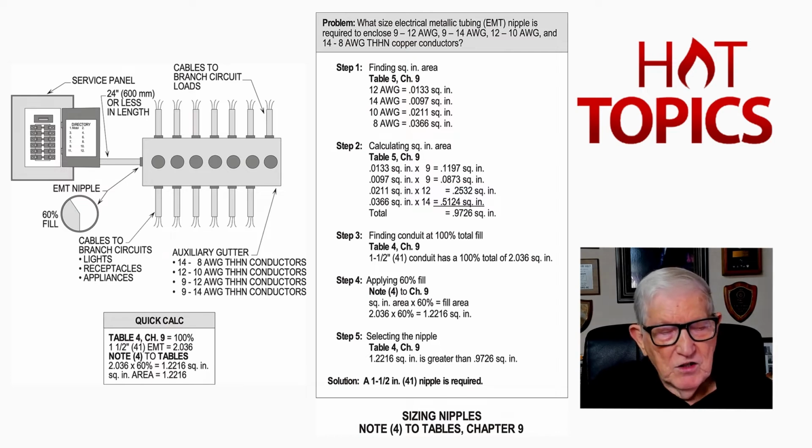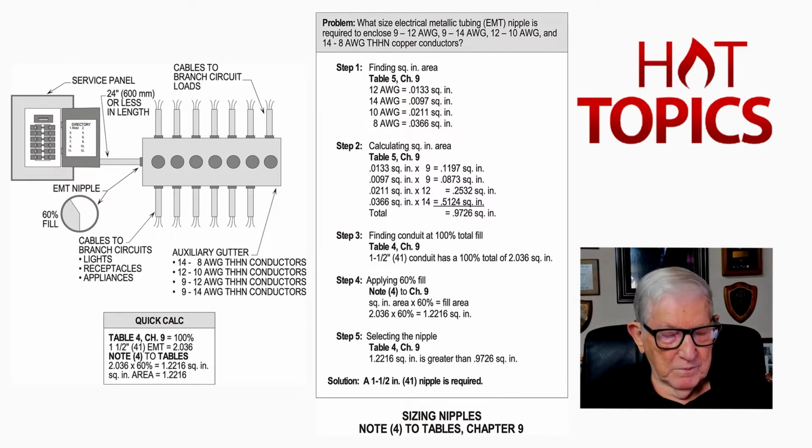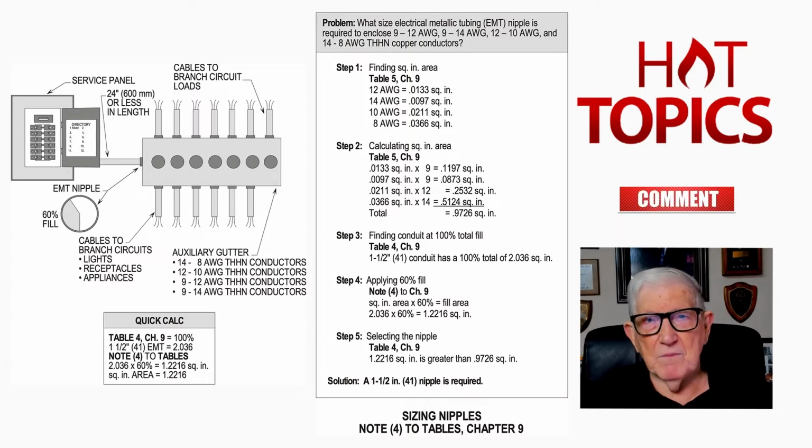And if you had 1.5 inches, it would be the same procedure. You get your 60%, but instead of like the old days, us having to know to take 60% fill, it's automatically given to you in the table, see? And always the right-hand column will give you the 100% fill in the table. Now that'd be for EMT, and you just go through here and pick out a table. Say if you had flexible metal conduit, then you just drop down to the third table, Article 348 listed there. They give you the same thing, see?